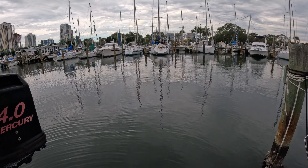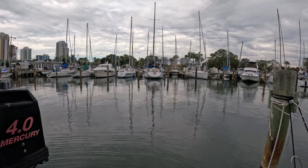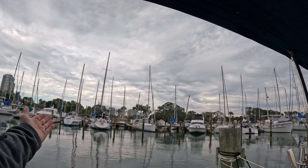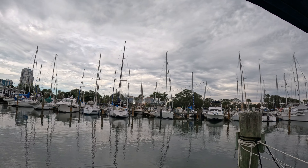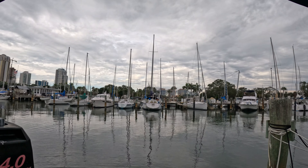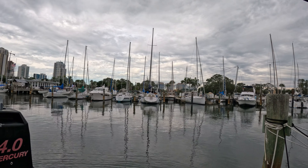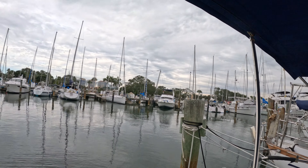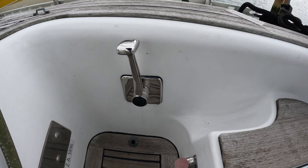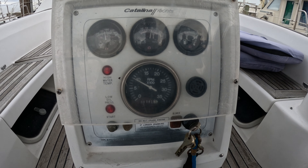We're going to back up after I put it in neutral and untie the lines. I'm looking at which way the wind is blowing — looking at the top of the mast and the arrows — wind is coming out of the north, coming to my stern. So I can take off the bow lines because the stern lines are holding us. We'll take off the bow lines first, then slowly creep the boat back by hand and take off the spring lines, then the stern lines. I put it back in neutral — RPMs down to 900, engine temperature still good.